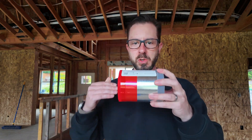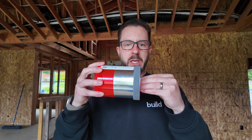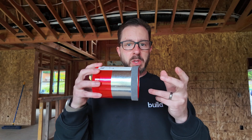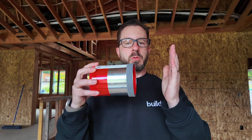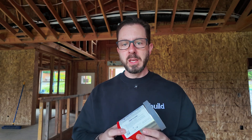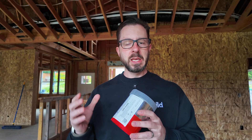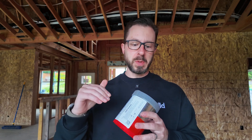I'll be curious — this is the first time we've ever used these. I think when it comes to a horizontally run duct, we shouldn't be getting a whole lot of wind coming in, but we do have a couple of our ducts that run up through the roof, and I think that's probably where this is going to be more applicable as far as having a tighter home. This should help us out during construction to get a lower blower door number, but more importantly, it's going to keep that untempered air from outside from coming inside.